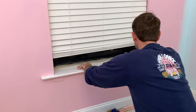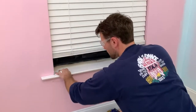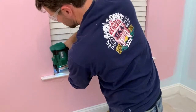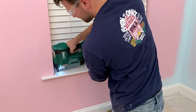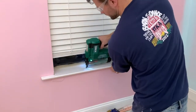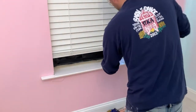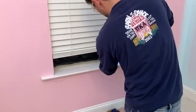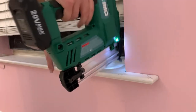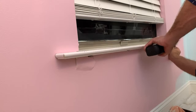The wings extend so that the casing can come down and sit on top of that sill. I'm using some two-inch brad nails — you can see I'm banging it into place with my fist to get good adhesion to the adhesive, and then using the brad nails to punch it into the actual framing. Once that construction adhesive cures, this is not going to go anywhere. You can see that chunk of drywall under there — that's okay, it's going to be covered up by what's called the apron, which I'm going to make next.